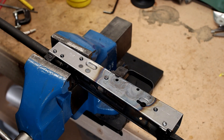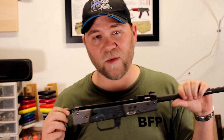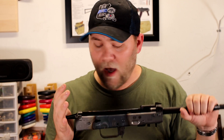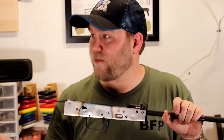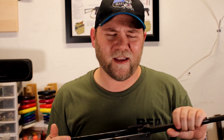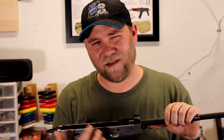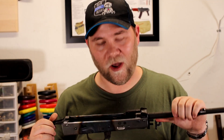We're ready after this to move on to populating the barrel. Heat treating and tempering is pretty simple if you've got map gas and a little bit of water. If you really want to go hardcore, you can also do it with oil — the first AK I ever built, I did an oil quench. But it's a lot messier; you have to clean it and degrease it. Water is a lot easier and works just as well.